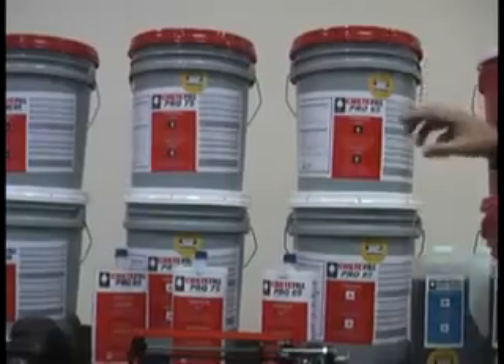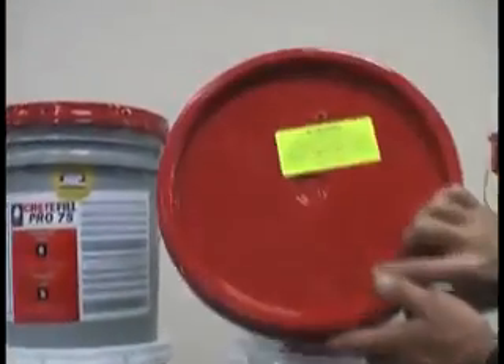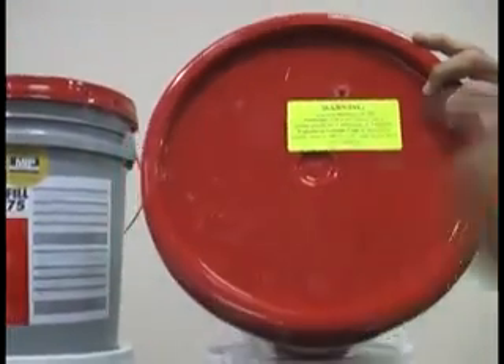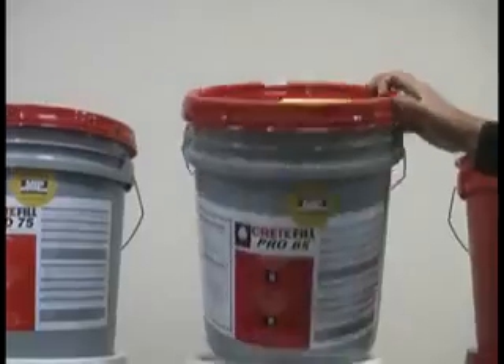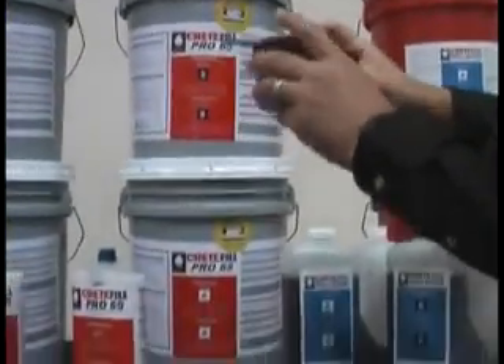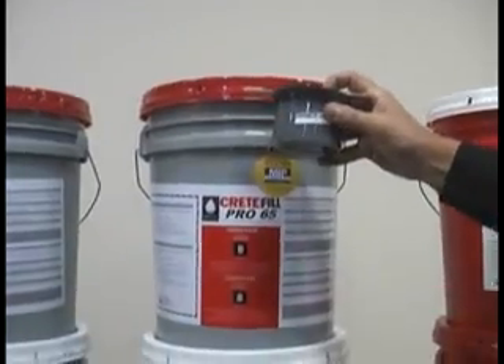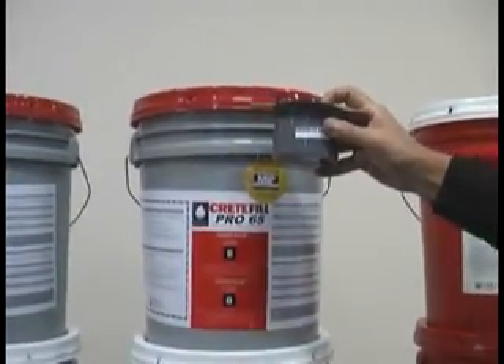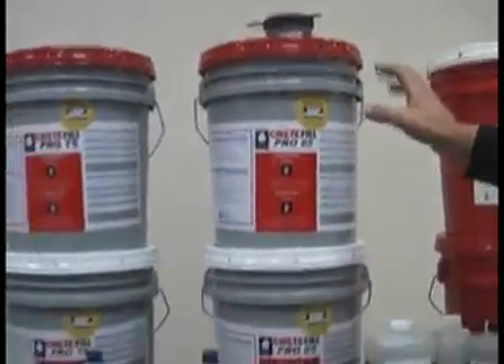All of these materials are a 1-to-1 ratio. All products on the B side are untinted and must be stirred up before use with the machine. We provide a tint pack that must be added to the B side before loading it into the polyurea machine. That's on the bulk system — the 10-gallon kits of the different Pro Series.